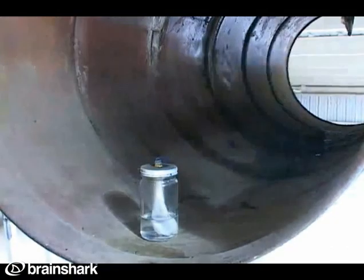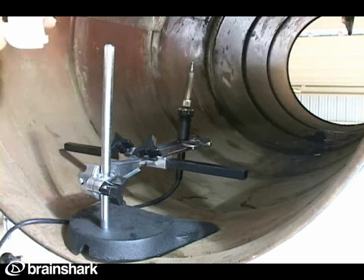Take a look at this video. You'll notice when I spray the duster upside down — whoosh — you'll see a flame come out. It's a flammable duster when held upside down. Right side up, it'll put that flame out. I do the same thing to a soldering iron. At 950 degrees, nothing happens because it requires a spark or a flame to get going. So if it's just a hot surface, it's okay. What you're really worried about is live circuitry and open flames.